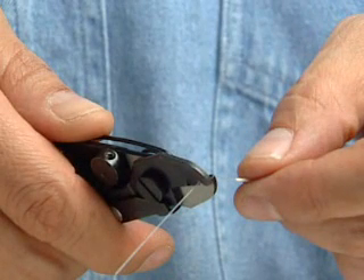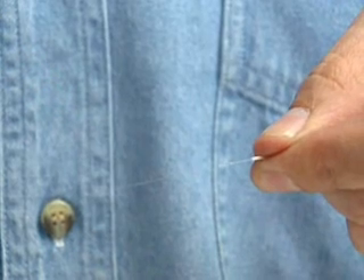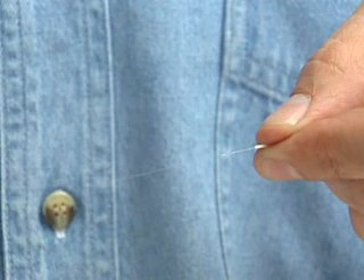Close the tool at the desired strip length and push the tool off the fiber using a slight pressure. To complete the preparation, wipe the fiber with denatured alcohol. This will ensure your fiber is free from contamination.